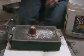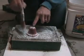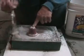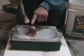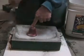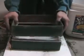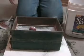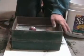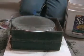Now I'm going to put some parting dust on it. And now we're going to put the drag on — I mean the cope. We did the drag first. And I'll put the grease screen on — I got it at the dollar store — put that on so that I can have good facing sand.